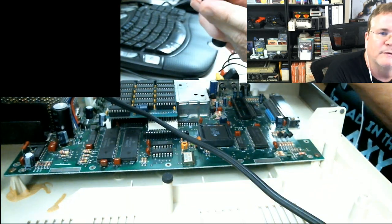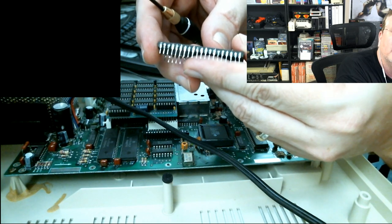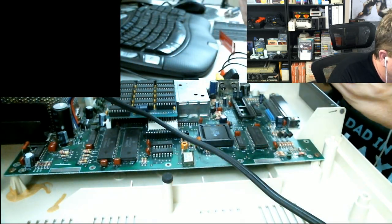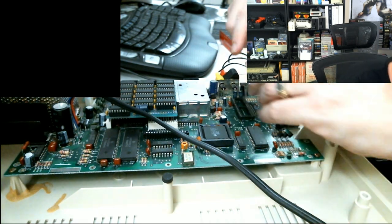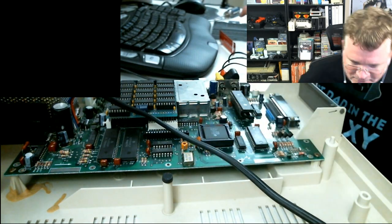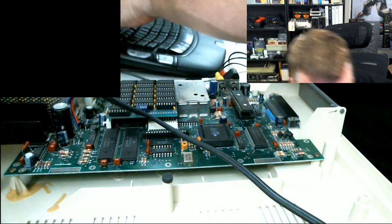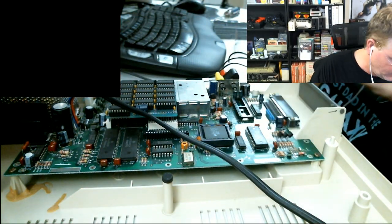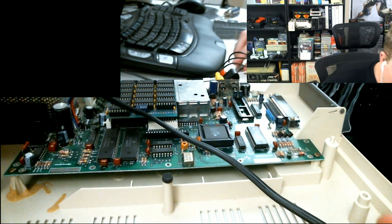Okay. So here's the CPU. I don't know how well you guys can see it. This is the current CPU I just pulled out. Yeah, the sides of the legs look like they've got, hold on, camera. Solder shrapnel on the sides of these legs there. There's some serious... It almost looks like maybe they broke off a few leads and had to solder them back on. There's solder shrapnel on the sides of the CPU. Now, I didn't notice which way this thing came out, so when I go to put it back in...